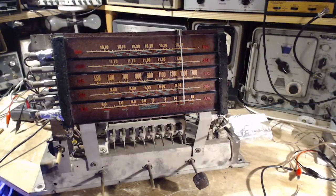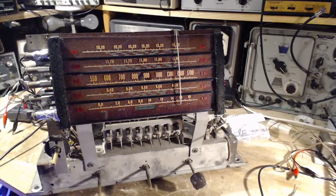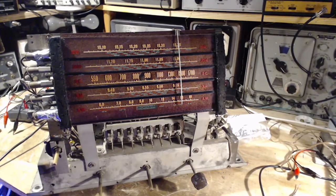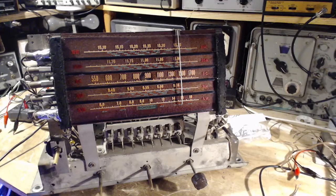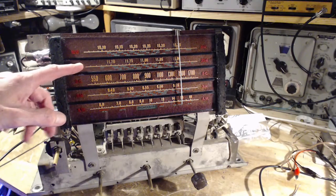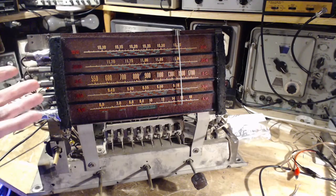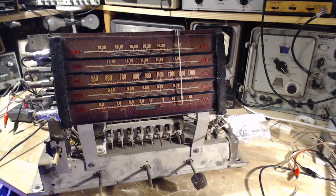So I think the first thing I want to do is repeat this analysis of the local oscillator relative to the target frequency. Is it above or is it below? And my expectation is it should be the same on every band. I would really be surprised if for some reason one band has a local oscillator in the wrong spot, on purpose, like a factory setting. An error in subsequent alignment is possible. An error in the factory during the alignment is not very likely.